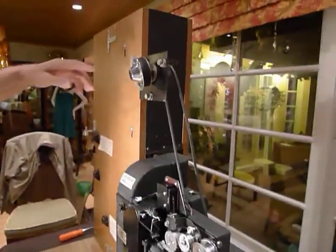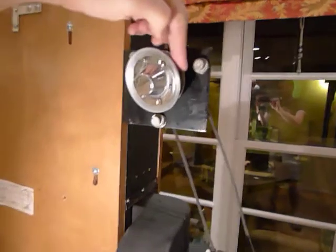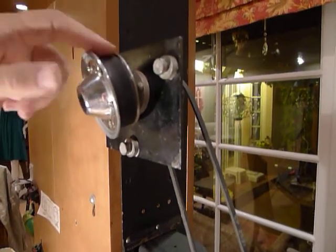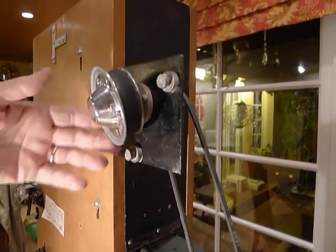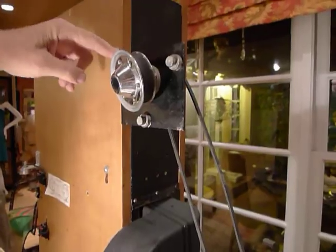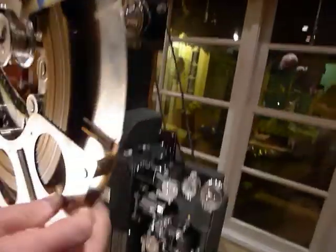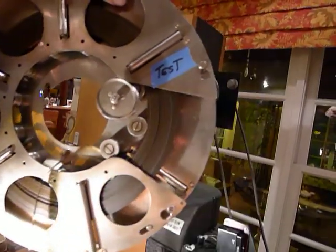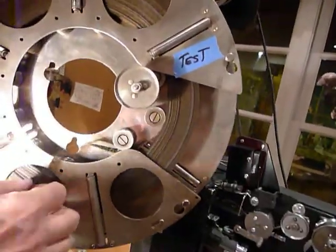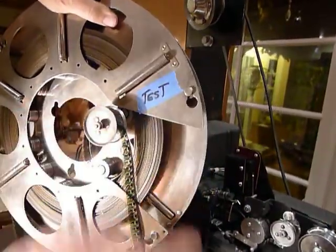When you load your film reel, it's important that you have a good neoprene band on the inside of your reel that is not smooth, because this is what picks the film up off the film reel and puts it through the projector. You've got three pins, and on the film reel the bottom one should have the open part off to your right. Make sure the film is coming out, making a half turn and going over the reel — it comes out and goes over.